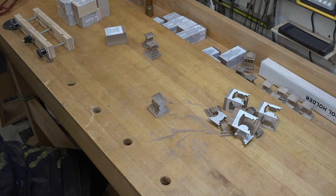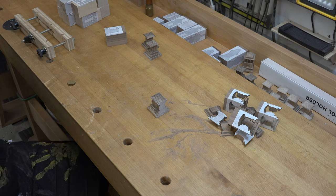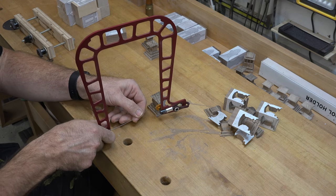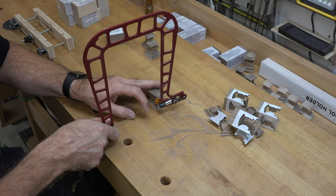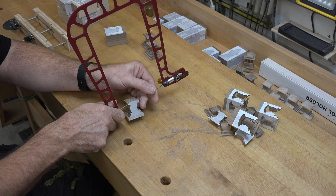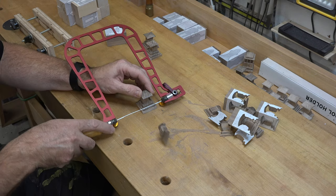Now this piece is not ruined, not to worry. A fret saw in this instance is your friend. So what we'll do is I'm just gonna take a fret saw. I have the same kerf blade in it that I have in the scroll saw, because conveniently they take the same blades. And we'll just install this blade and gently, and I mean gently, don't go all aggressive here. Don't think that you're cutting a 2x4. You just want to gently work your blade down to the area.